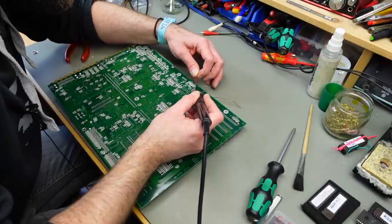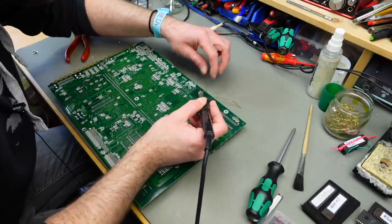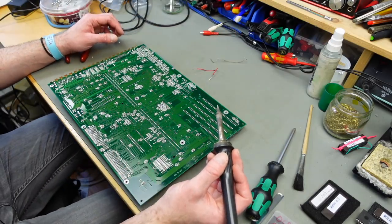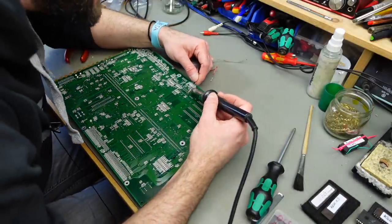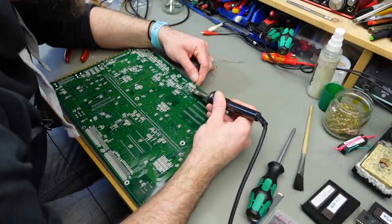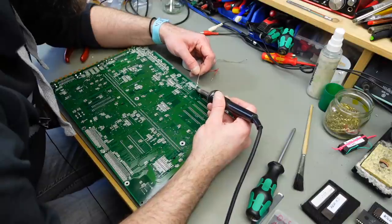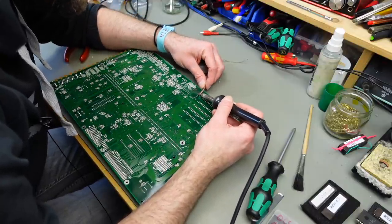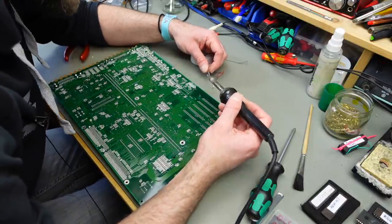Wow, this is some terrible work. Ooh. Yuck. And it smells terrible, too, whatever the solder was that they used. Oh, it smells like vinegar. Somebody was in there with vinegar already, I guess. And somebody was in there with vinegar and maybe didn't remove the vinegar, which then causes more corrosion instead of cleaning up the old corrosion. Or it cleans up the old corrosion and then causes new corrosion by the vinegar.